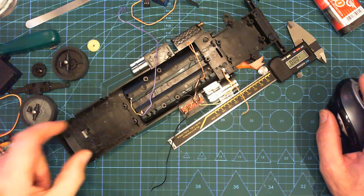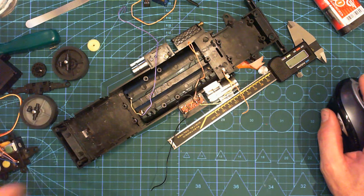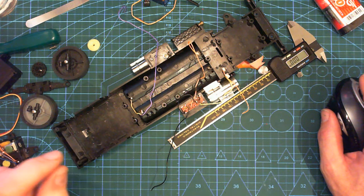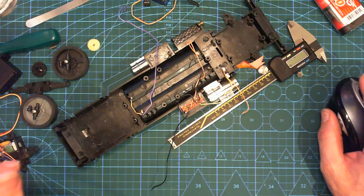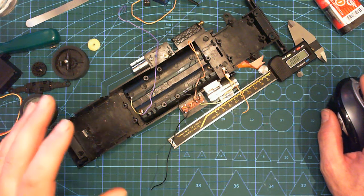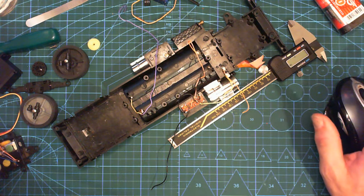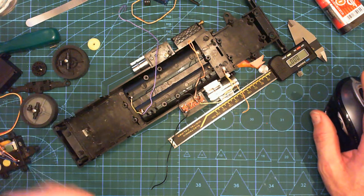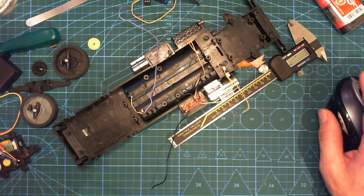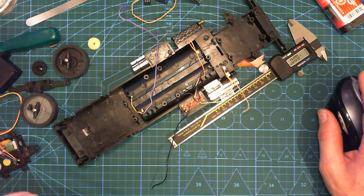Yeah, I've had a look, and there seems to be some motors out there. I think they're by a company called Surpass, but they've got some good information, and the physical size, I think, is a 2040 or 2030, but I'm still finding out about this whole kV. I mean, kV to me is 1,000 volts, but they're talking revolutions per volt. So I've got to look at the gear ratios that would be available. That may be a way that I go for this, because the motors do seem to be small.